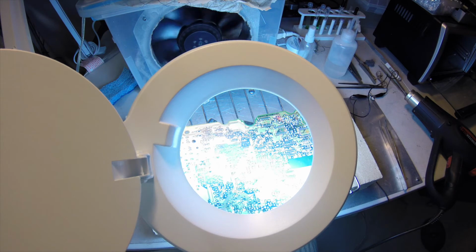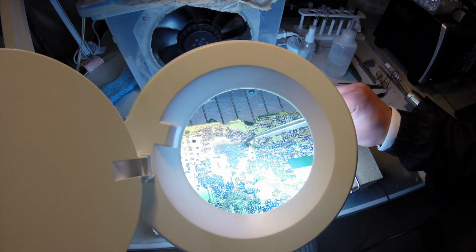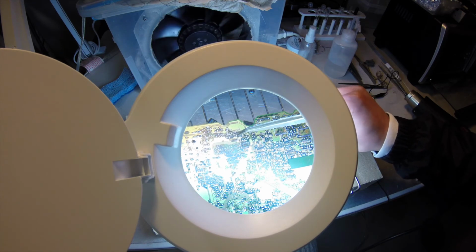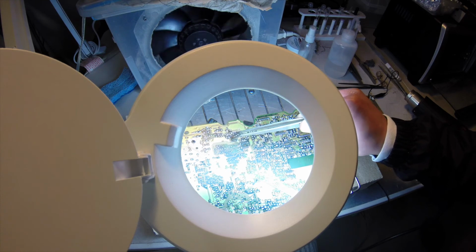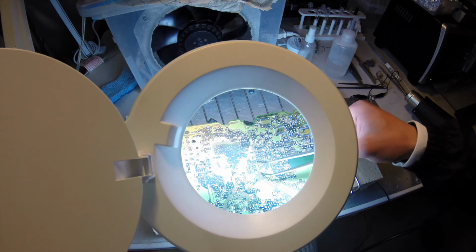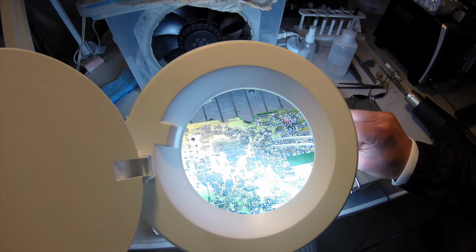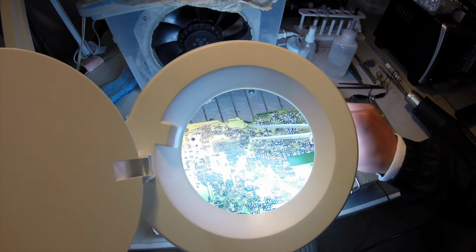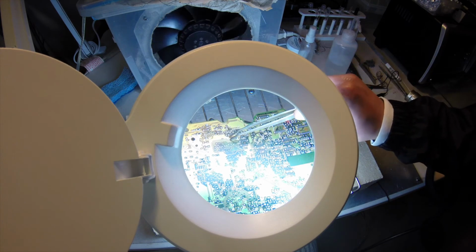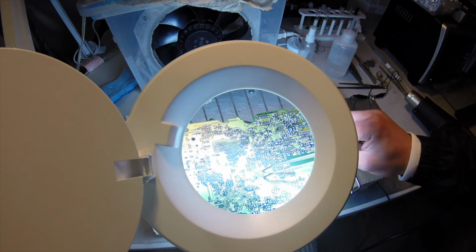Okay, so I noticed that there's, right here, see these? It's like some epoxy spots. And the solder would actually melt, but these epoxy spots wouldn't. So it seems like the solder didn't melt. And I'd stick it in there for a long time in really hot temperatures and it still wouldn't. I think I ruined the chips, so I'm probably just gonna discard them. But I'm pretty sure it's because it's on the back side, so when I put it through the reflow oven it won't fall off before, so yeah, this sort of sucks.